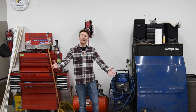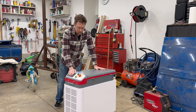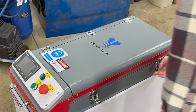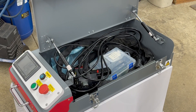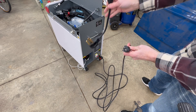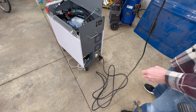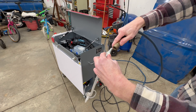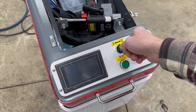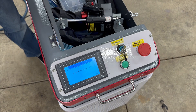Now that you've had a crash course in laser cleaning machines, let me show you how easy they are to use. First, I'll need to roll the FLC200 over to my work area where there's a 220-volt outlet. The pulsed machines are smaller and lighter than the water-cooled continuous wave ones. I really love the design of this machine because of the way everything is stored inside, where it stays dust-free from all the work I do in the garage. I did need to buy a $10, 110-volt to 220-volt adapter from eBay because this power cord has a 110-volt style plug on the end. I need a compressor to connect an air line — it doesn't require much air pressure, but it's important to use clean, dry, compressed air to protect the laser head. Next, turn on the machine and let it count to 10 while warming up.